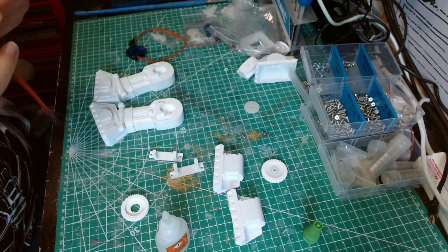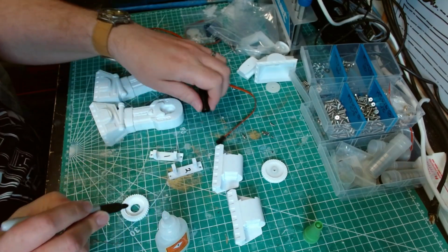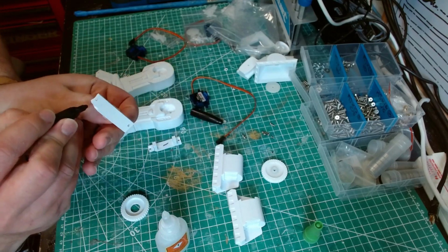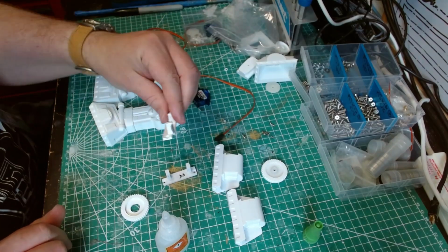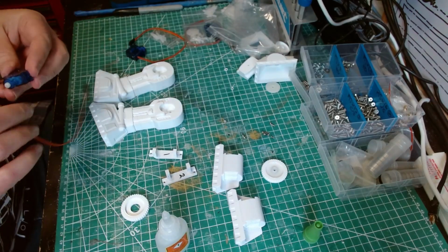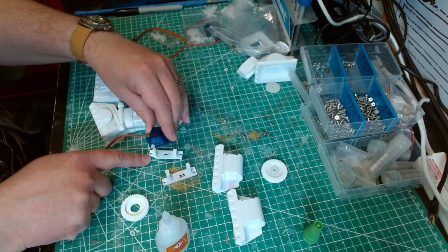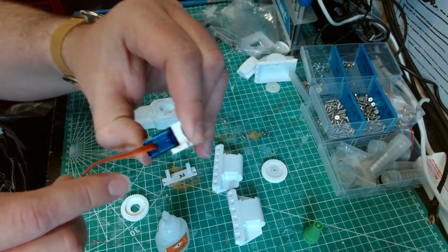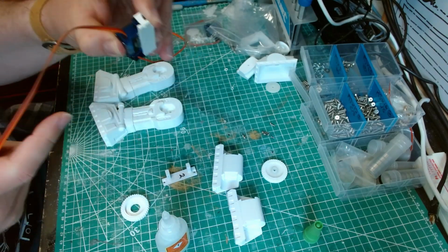I'll tell you what, let's label it so we can. Right. There we go. Right, on number 1, we've got the cutout on this side where I just marked. We want to mount the servo head, servo shaft, closest to that cutout point, and mount it this way. So the servo bracket holder, and then the frame itself, and we're going to screw through that way.